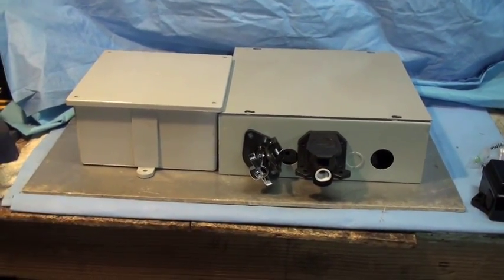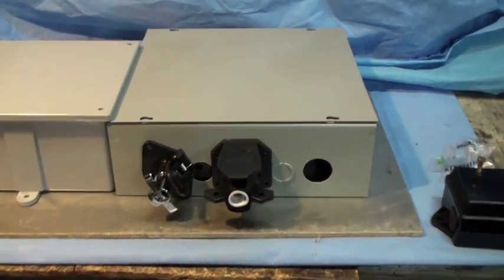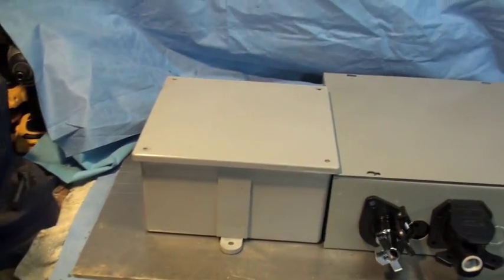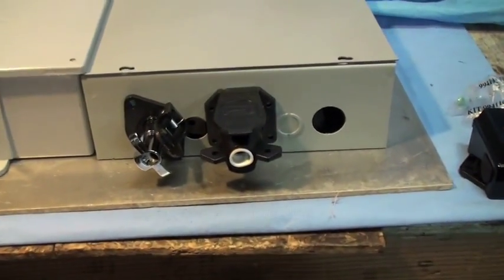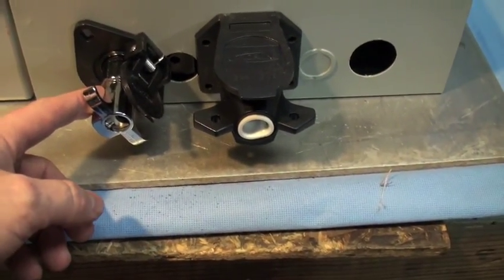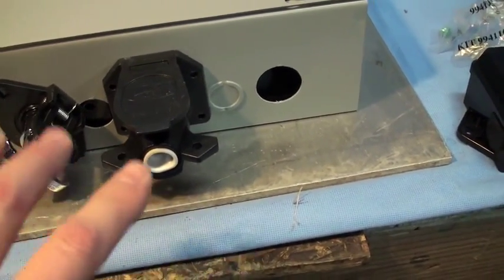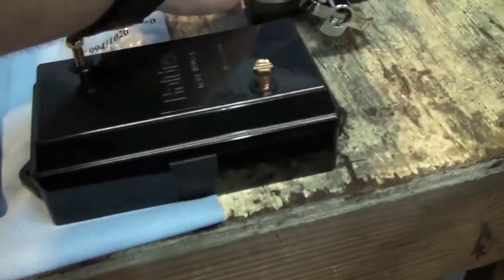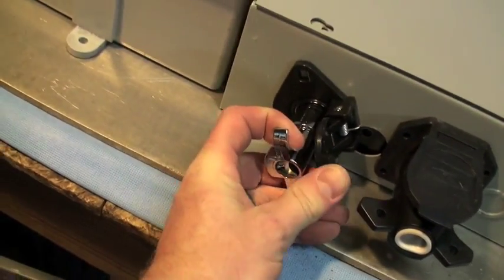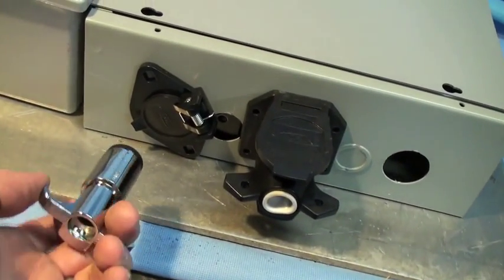This is my next thought of how this should work. I've got two boxes here. One is going to have the low voltage wiring and the other is going to have the high voltage wiring. I've made a couple of quick disconnects using a six pin trailer hitch connector and a seven pin trailer hitch connector, so I've got 13 wires that can go in. These things come out relatively easy - they slide right out just like that and plug right back in, so I can disconnect the box fairly easily.